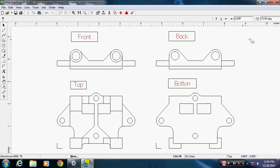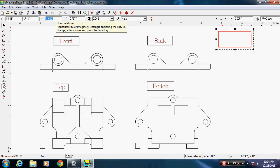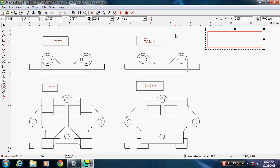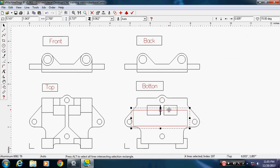I'll find a little spot to draw. 0.737 at 2.7. Let me verify that. Make sure my caliper is zeroed and not still set for the parallel. Alright, 2.7. Now this will come down and actually lines up. I have to center it.